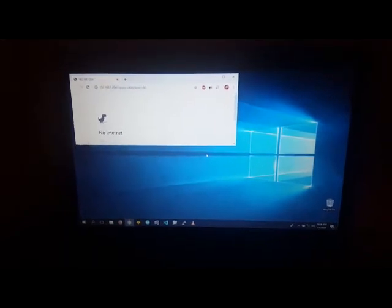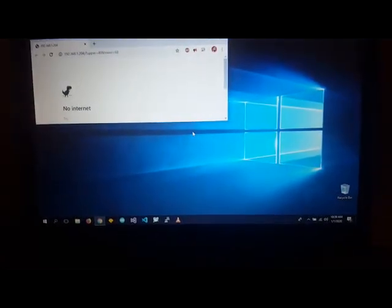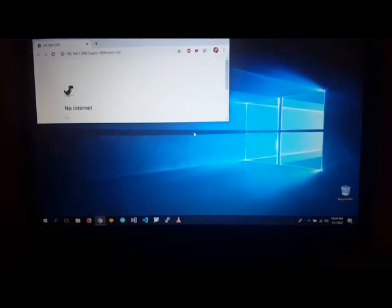Also, when the laptop powers on, it tries to find another device at a specific IP address. And once it detects the Wi-Fi network, it will connect to it, and it will start to refresh the web page that is served by an ESP8266, a NodeMCU that has a DHT11 humidity and temperature sensor that controls a window in one of the rooms.